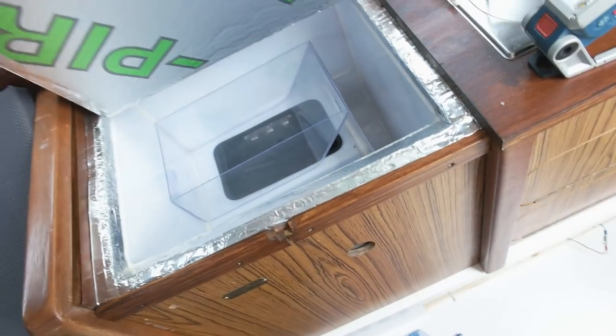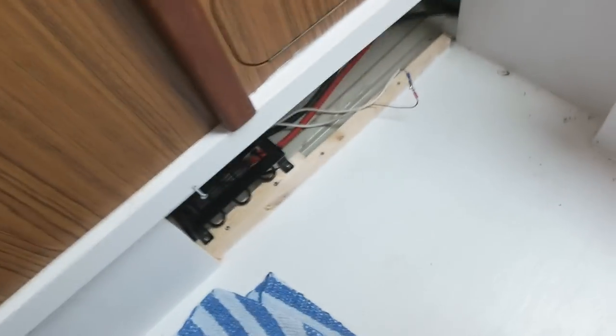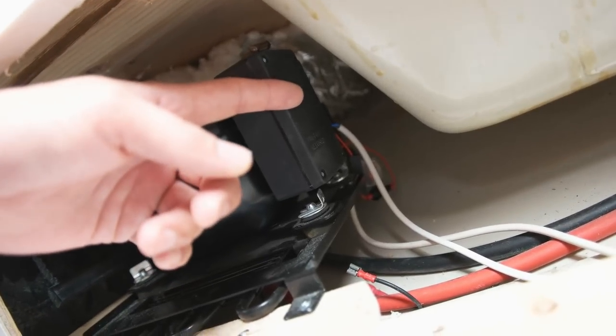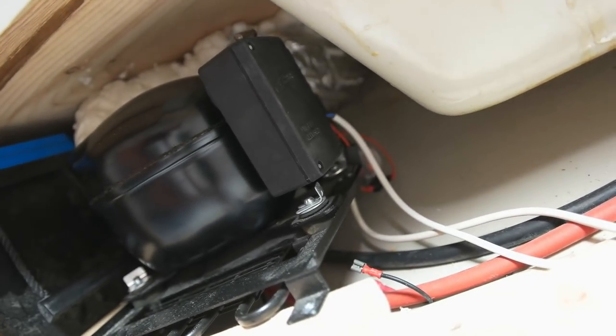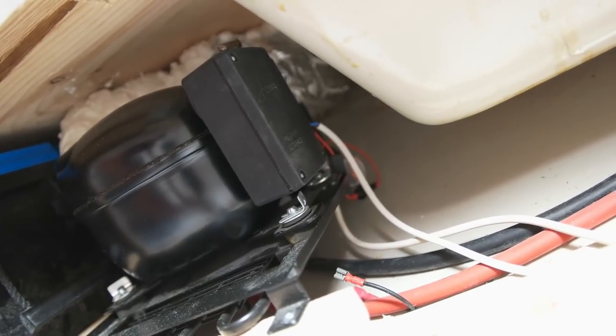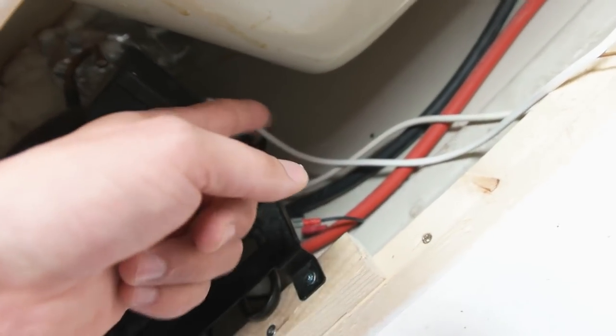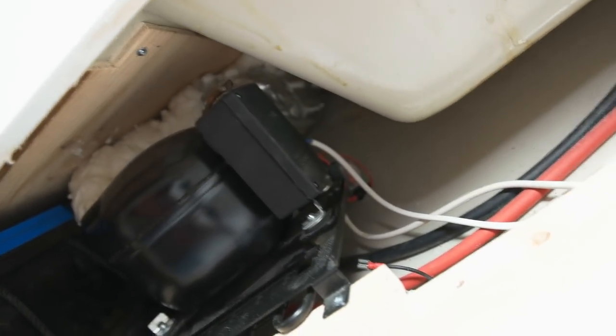I just put it on and yeah, I got a massive problem with the condensation because the pipe tube, it had some insulation on it, but it wasn't enough and it wasn't tight, so it condensed a lot of water from the air. Yeah, and it all poured down here and went under the floor. So that's not good when you have a wood floor and this is not accessible over here.